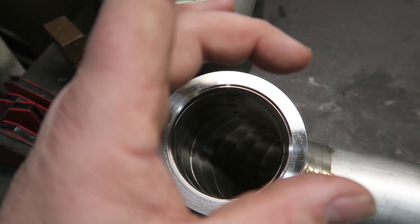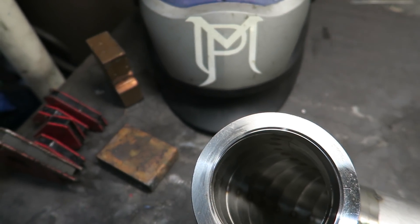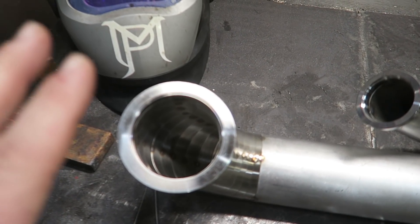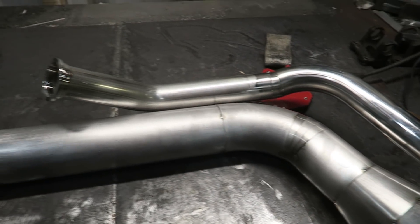It will literally be a piece of tapered aluminum that slides in and holds snug inside the pipe, with a hose outlet on it so we can take the purge hose from the tank on the left and insert argon into the pipe. On the other end, we're just going to cover it with foil and poke a couple holes in it. So we're going to head over to the lathe — I'll bring you guys over there with the GoPro.